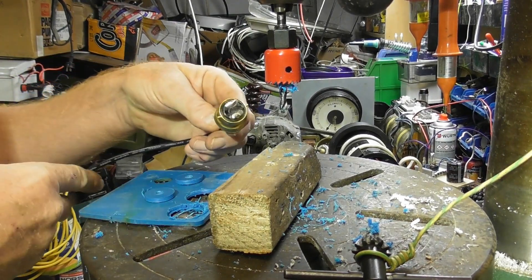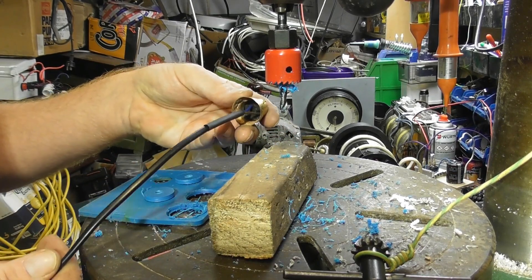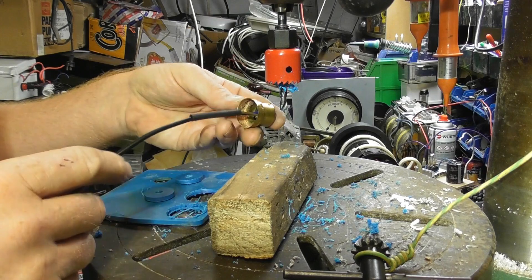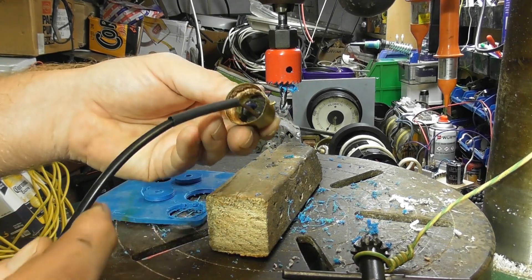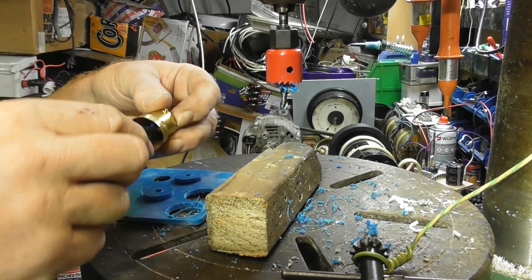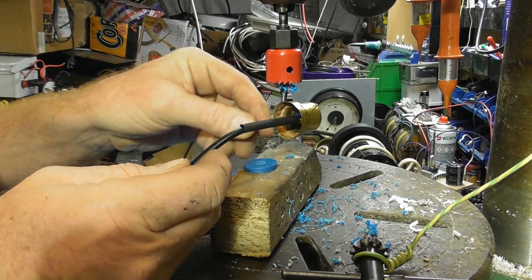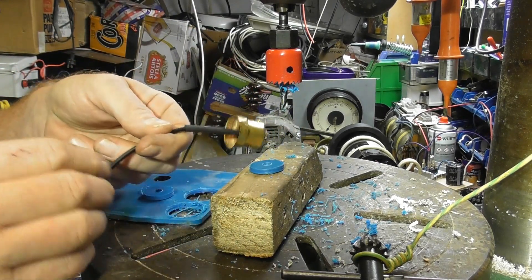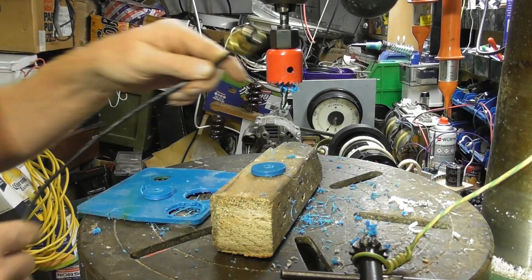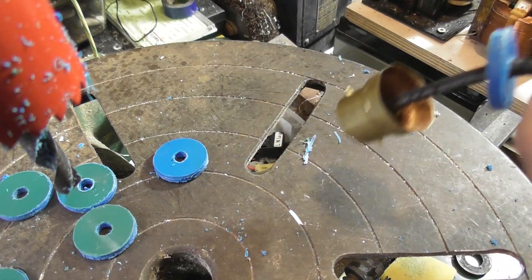Just to make these fittings — the B22s — I just like to be able to change a bulb quite quickly. So I made an adapter with a bit of two-core wire in here, and then I'll seal it up with a gland and washer, which is just drilled out. I'll put some potting in there — that gives it quite a good secure connection. I'm going to pot this in with some glue here, so I've got this all ready to roll.